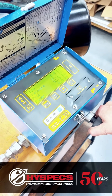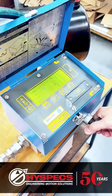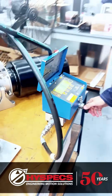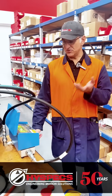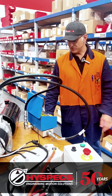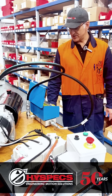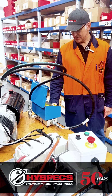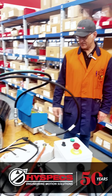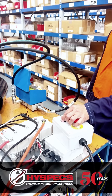You can see the motor trying to keep the flow steady. It will work around 100–120 bar, and you can feel the motor compensating — the more pressure I put, it increases the torque. Even increasing the torque, the flow stays around 5 liters per minute. With this setup we can change the speed.